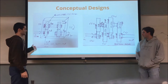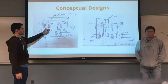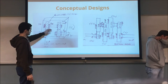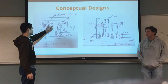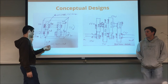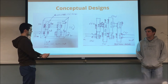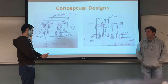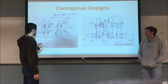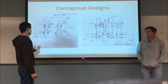This slide represents some of the design iterations we came up with while developing our final gearbox. The first design had four gears with two main reduction steps, going from 1320 input RPMs down to 60 output RPMs, with 330 RPMs on the intermediate shaft. We started with a 14.5-degree pressure angle but later realized that it's not typical, as it's outclassed by the 20-degree pressure angle, which we used in our second design. We concluded the first design wasn't ideal because the gear sizes were too large.